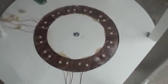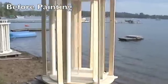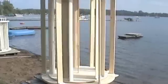That's how they look, so the one-inch magnets will ride on top of those. The wind is actually about three to four miles per hour - barely a breeze - but we're getting some movement at about 30 RPM. It's a three-and-a-half inch PVC outside diameter split in half, and the wood is a trim mold, two of them put together, just screwed in there.